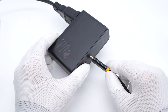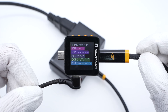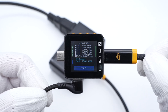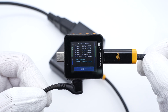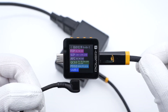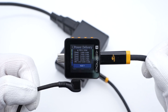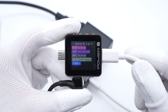After connecting it to the power supply, we use the ChargerLab PowerZ KM002C to test the charging protocols. USB-C1 supports FCP, SCP, AFC, QC3.0, QC4+, PD3.1, and PPS protocols. It also supports six fixed PDOs: 5V/3A, 9V/3A, 12V/3A, 15V/3A, 20V/5A, 28V/5A, and a set of PPS. USB-C2 only supports PD3.0 instead of PD3.1; the rest of the protocols are the same as C1, but the PDO info shows it cannot support 28V/5A/140W. Finally, USB-A supports FCP, SCP, AFC, and QC3.0 protocols.